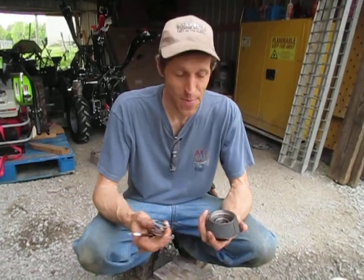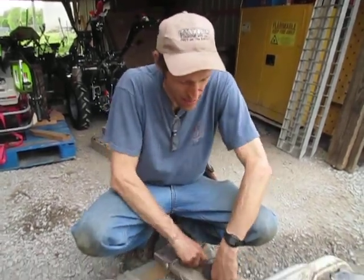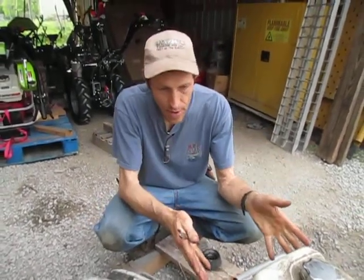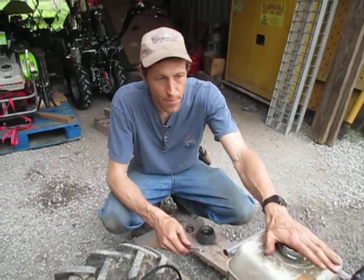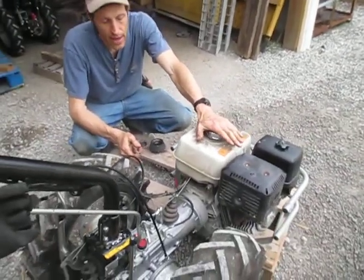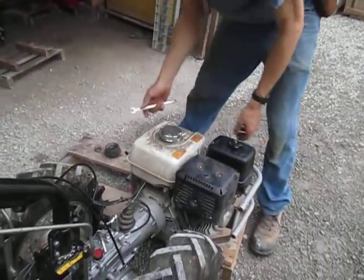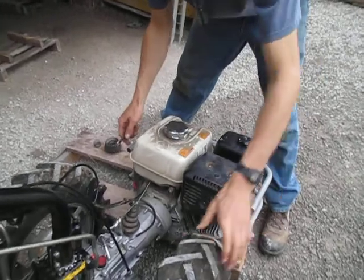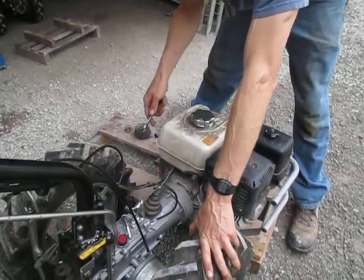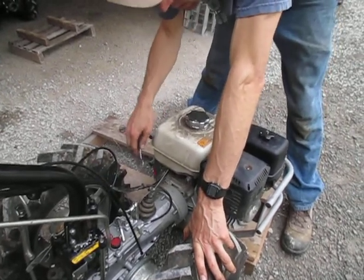This is 2019, so that's the current price. As this video ages, that price may go up a little bit. Right now, $69. Getting it in there is a matter of taking the engine off the tractor. Pictured here we've got a Grillo G110, but it's the same active clutch system in all Grillo machines from this point forward — whether it's a G85, G85D, G107, or G110. On a G131, it's different, so there's a different procedure on that.